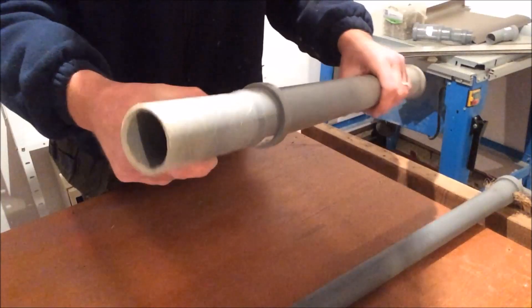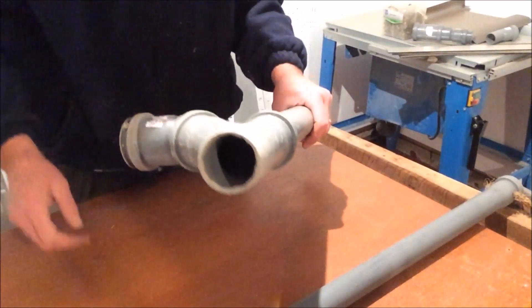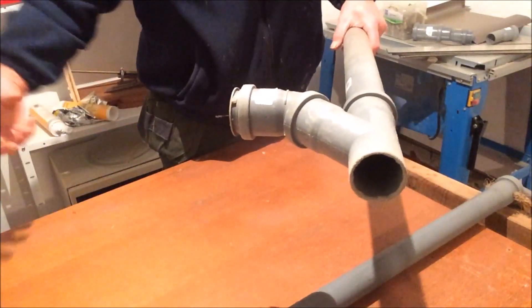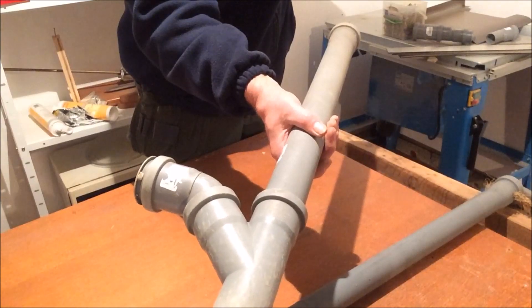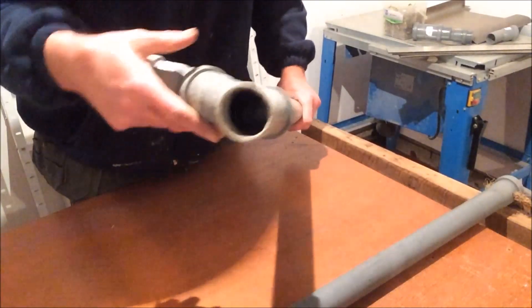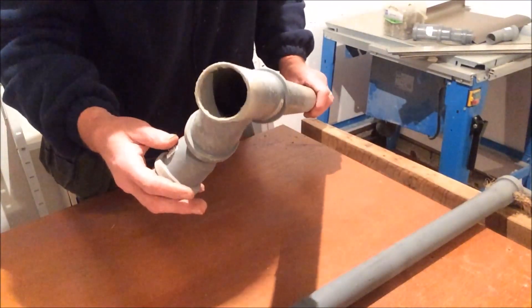What would work well with this is a two-way valve. The problem with a two-way valve is that you're going to get bits of gravel and grit stuck in it and it'll stop it from opening. But if you could do a two-way valve, you could potentially have a pipe going to your sluice or into a bucket — when you suck it opens, and when you push it shuts and pushes your material out. I've tried a bit of experimentation but what I've made doesn't work yet. It would have to work like a butterfly valve because it's round, so it can close and open.